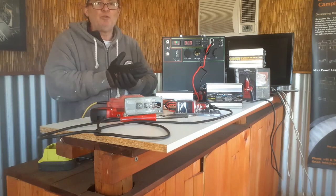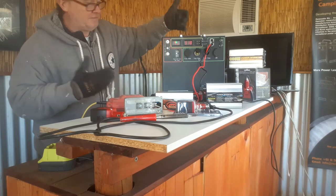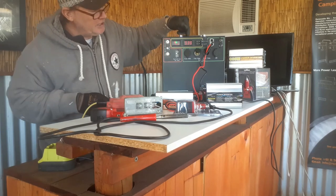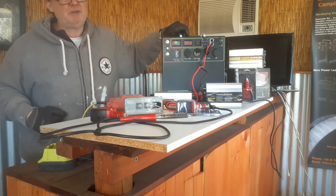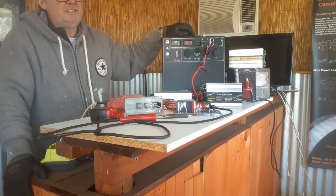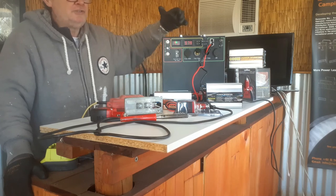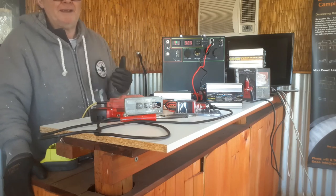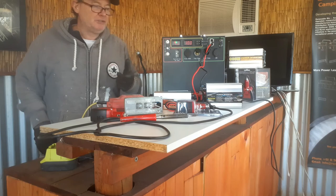To summarize: do not run inverters at full capacity. The Nomad has a 20-amp, roughly 200–250 watt maximum output. As shown, the multi-speed jigsaw can run fine as long as you don't exceed 20 amps. Push past that and it may be okay for 10 minutes, but you'll run into trouble. The unit's BMS and Bluetooth analytics tool can tell you if you've drawn too much current or overloaded the system — and you can reset it, as shown on our website. But don't expose electrical products to currents beyond their ratings and then expect them not to fail.